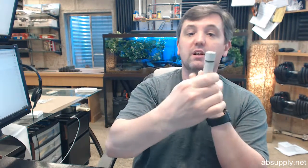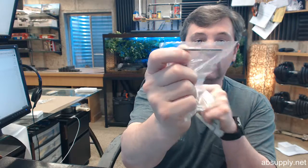The certifications and hinge selection guide is the table to use, and proceed as you see fit. There's also a link below this video to a document called Installation Instructions. You're going to install or hang the door with the spring hinges. You're just going to get it hung, with the tension collar pointed towards the top of the door. You can install it either way you want, but with the tension collar pointed towards the top, every order that you place will include a tension rod.